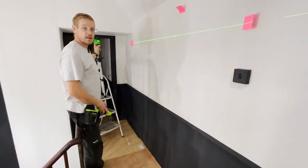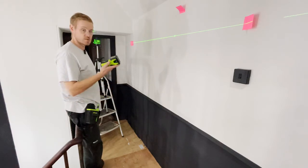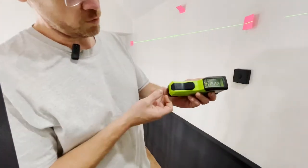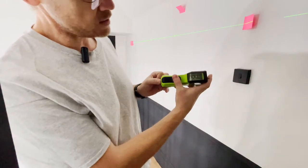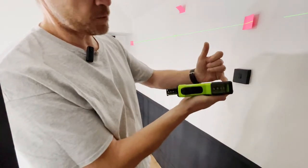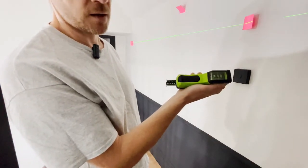You don't need a laser, but it does make life easier — it's a top tool I reckon every home DIYer should have. While we're talking about tools, you saw me fiddling with this tape measure — it's quite an unusual tape measure. It's called a top-reading tape. You can still read it like a normal tape, but it also reads out across here so you can set it very accurately, lock it off, and the distance between here and here is displayed on there. It's a new acquisition but I'm really starting to like it.